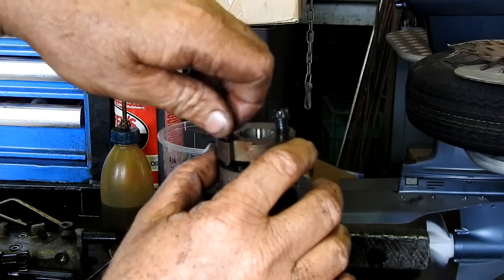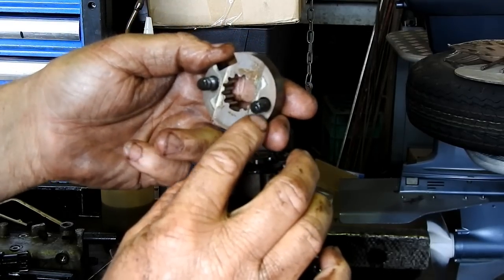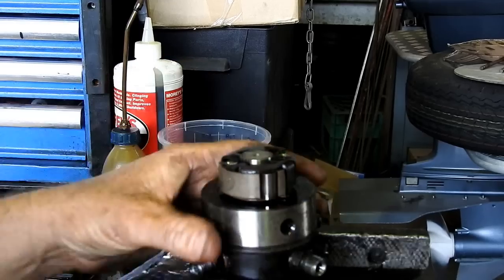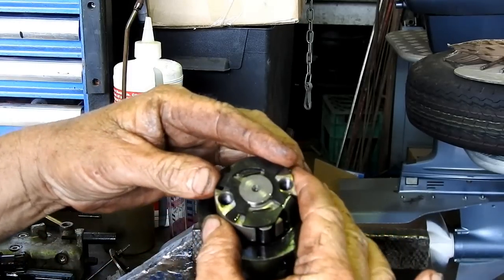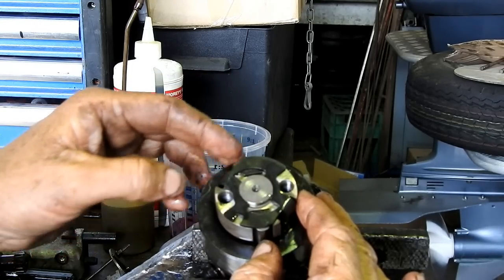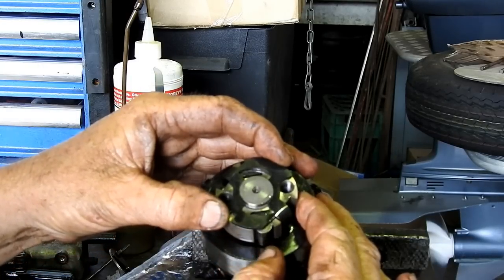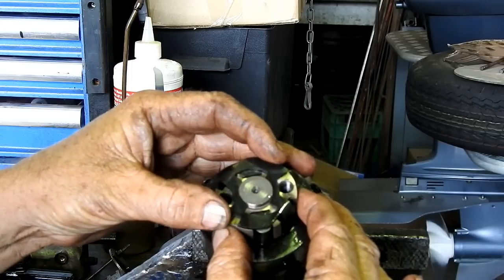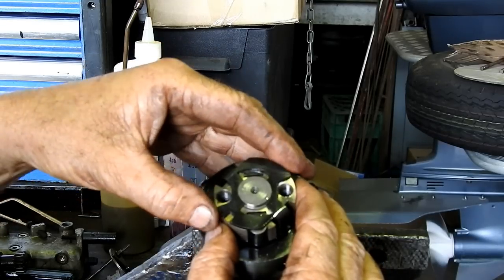On all this, there's witness marks everywhere. And you'll see the shadows where everything sat. Look for that, it does help. Now, on the top of the head, when you actually adjust the fuel setting, you'll see in there, you can see the rollers, and depending on where the fuel setting is, if it's way back here, those rollers come out further, and then if it's way back here, they can't travel as far. So that's how they decide how much fuel pumps in each stroke.